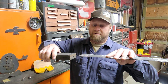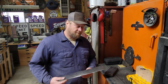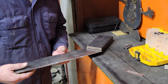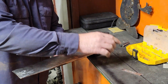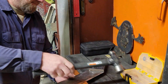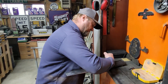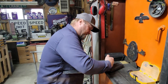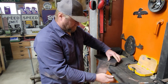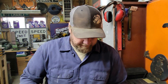The width of the cutoff blade fits 18-gauge steel perfectly. So we're going to punch out a 3/8 to begin with. Drop your bolt in the hole and work it back and forth sometimes to get a tighter fit. There's your 3/8 punch.